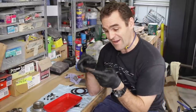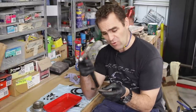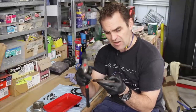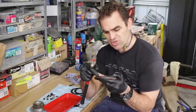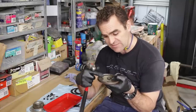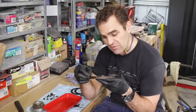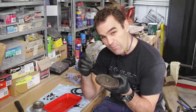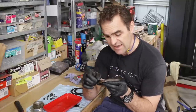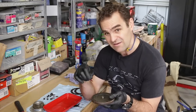All right, that took a fair bit more than I expected. I found that sitting the ball-peen hammer onto the top and then knocking on that was good. I just wanted to try and do it without damaging the face too much, but I think I've got it reasonably flat now. All I'm going to do now is go around lightly with a razor blade and just get the residue of the old paper gaskets off and just see if I can get it nice and neat and clean, so that when the next one goes on it's not going to leak — I hope.